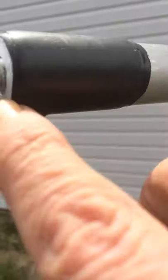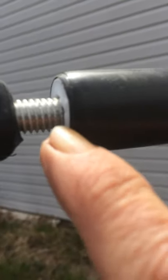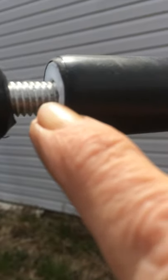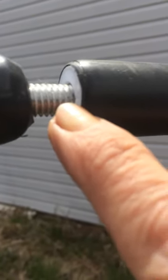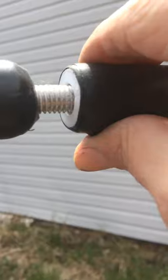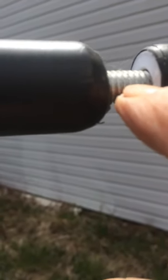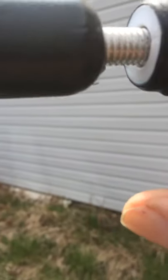I have plastic inserts in each end. What I have done is threaded a piece of aluminum rod to a 7/16th diameter. These plastic inserts were actually part of the plastic bolts — it is part of a set. There are two plastic bolts and two of these inserts, if you buy a package of bolts to put on your toilet seat, believe it or not. So there are toilet seat parts in the antenna. I have some large heat shrink that holds this all in place. In the center is the aluminum rod, 7/16th diameter — just ran a die down over that and cut the threads on there. And you adjust this and you can tune in your resonant frequency, no problem at all.